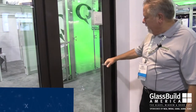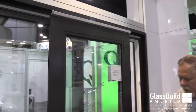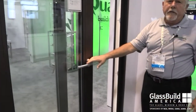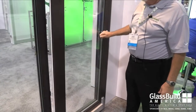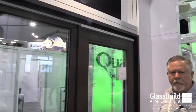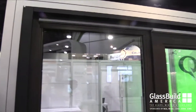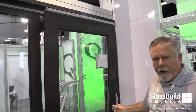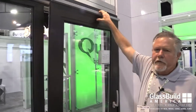This panel weighs about 220 pounds. It's triple glazed and effortless in terms of operating. It has the advantage that when closed, driven by the hardware, it's a compression seal — so it pulls against those gaskets, giving you very high structural ratings and water ratings. And if you just want ventilation, the panel is locked but you've got ventilation with the tilt feature.